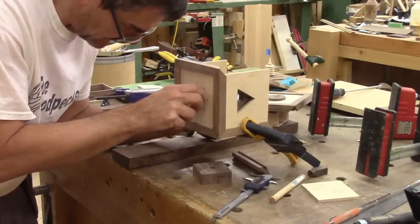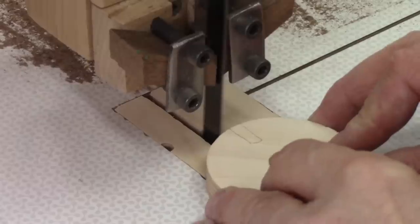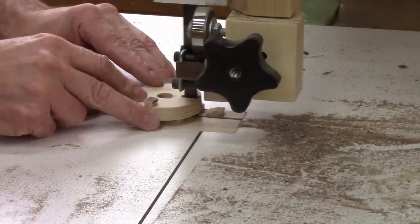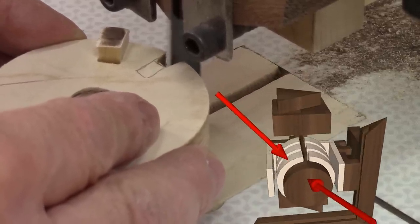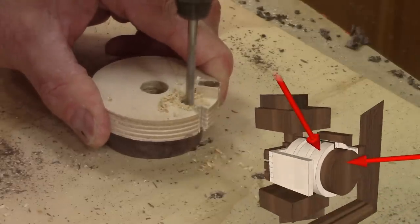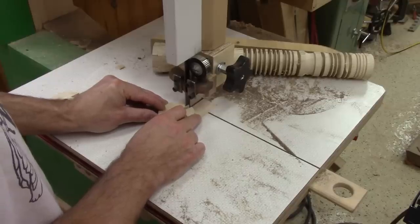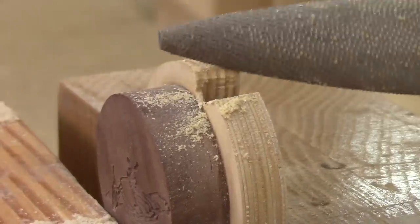So I create a combination and mark the rings. This is what I need to remove. On the ring to which the knob is glued on, the knob is in the way. I cut what I can and finish the job with a drill press and a chisel. When done, another one to go. When I'm done, I chamfer each opening a bit — this will help the unlocking strips.